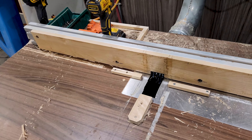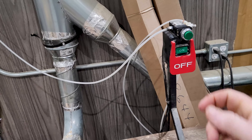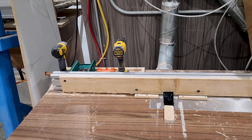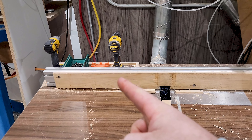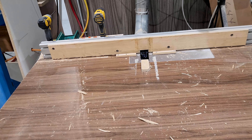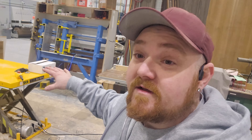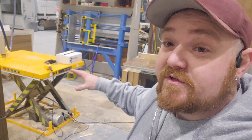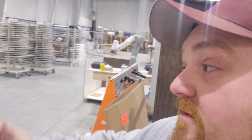We've made our own dado set and top, attached to a pulley attached to an air cylinder on a switch. We place the drawer on here, power up, put the dado set in, and then by pressing this air cylinder button it'll actuate the notcher in and out. It doesn't do any drilling, so we're still doing that by hand after the notching, but this is a very effective solution to notching our dovetails.